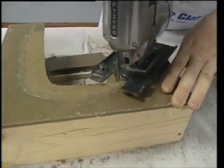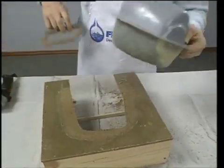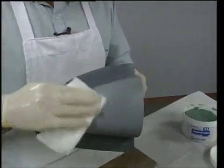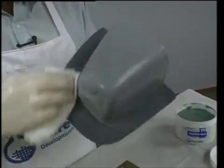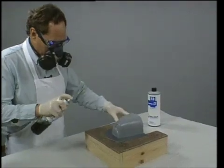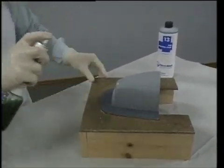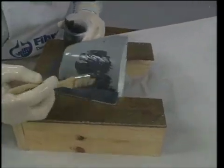Next, the hole in the parting board is cut to allow the mold to be turned over so that the other side can be constructed. The plug is then waxed as well as the lip of the mold half. Although the plug has already been waxed three times, the lip still requires all three coats of wax with an hour wait between coats. When waxing is complete, three layers of PVA are again applied, waiting two to three hours after the final coat before proceeding. After the PVA has dried, the other mold half is ready to be constructed.